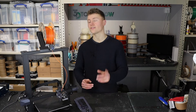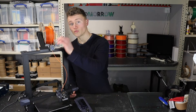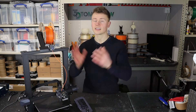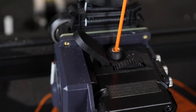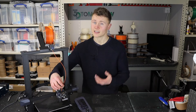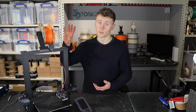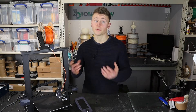The next thing I wanted to compliment is the attention to detail, specifically the wear resistant parts. Where the filament runs in at the top of the filament sensor there's a metal ring around it. That's brilliant because filament rubbing on plastic slowly wears it down and eventually you end up with a big gaping hole. Down here at the entrance to the extruder we've also got metal reinforcement. Even one 1kg roll is 330 meters of filament, so you can put serious wear on plastic parts — and if you're a high volume printer you'll notice that very quickly.